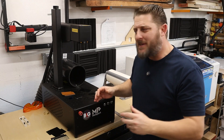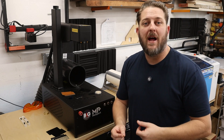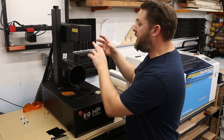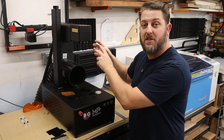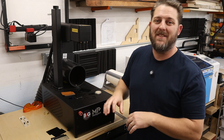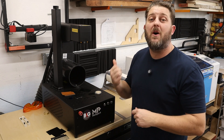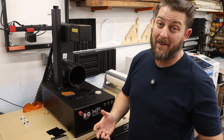The biggest reason I'm excited about this type of laser is the speed and simplicity. Being a Galvo style laser — in contrast to a gantry style laser — it can engrave incredibly fast. Small mirrors in the laser head move the laser beam from the source to the project at incredible speed. There's almost no maintenance: no mirrors to align, nothing. Just make sure your focus is set correctly and you're ready to go. This Galvo laser is estimated to last about 100,000 hours, so I don't think I'm burning this thing out anytime soon.